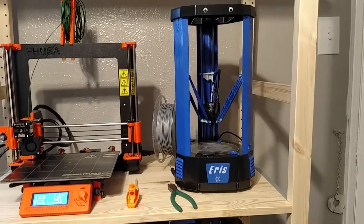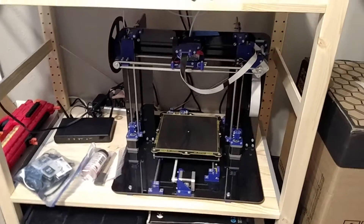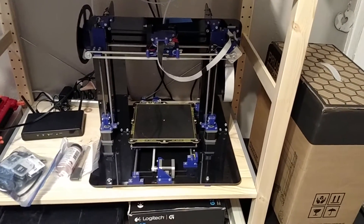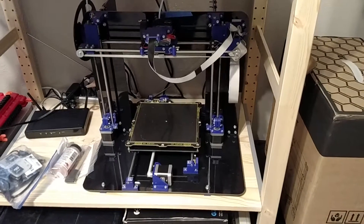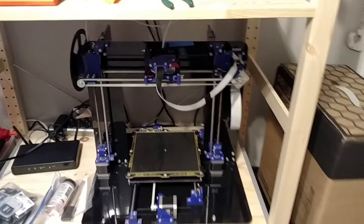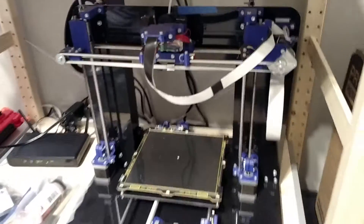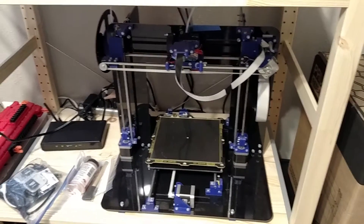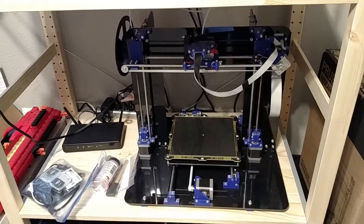I haven't really put a lot of time into it, but it does need some modifications. This is my Mendel 90. I kind of covered the Mendel 90 in the previous video and I'll probably go more in depth about it. The Mendel 90 is an older printer and it's taken me over a year to actually build. Since I have an E3D Titan extruder and E3D V6, I'm thinking about turning this into a Volcano hotend setup that will let me do 0.8mm extrusion. I'll be able to do really fast, quick prints on this printer.